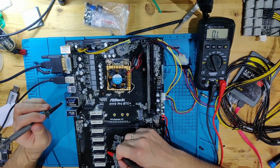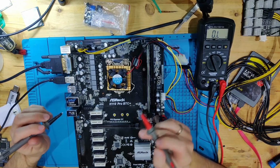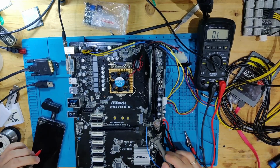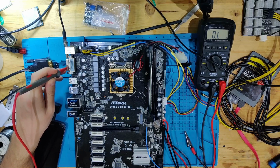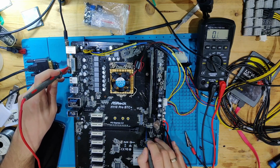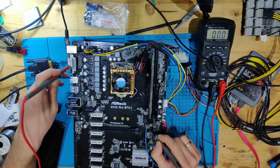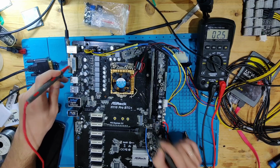We are going to try with voltage injection. We're going to put 3 volts into there. We're going to see if anything gets hot. And now something very interesting happened. I've now lifted the inductor from here and I've put on the output a wire, but as you can see, when I probe this place where I attach the wire to, you can see we have very high resistance. And if I go on its input, we see the short circuit that we've seen before. So this thing isn't shorted on its output, but on its input, which I didn't expect at all.